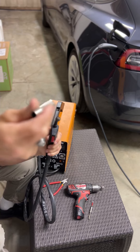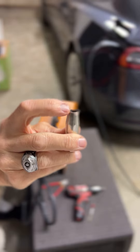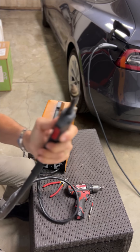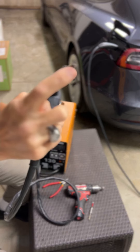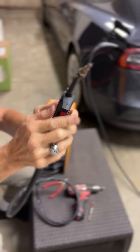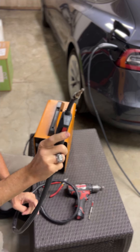The cover comes off. Because you got the tip too close to the work, you might find some spatter on it that you can clean off with a grinder or sandpaper. You may also find that the tip itself has melted a little bit, or that spatter got in there and basically welded the tip to the wire. When you press the trigger, nothing happens, and that's what eventually causes the fuse to pop.